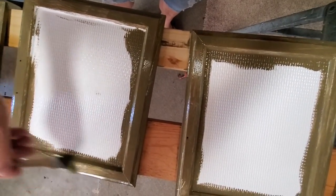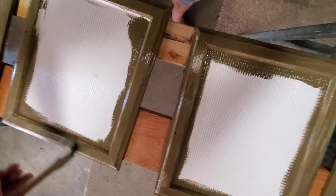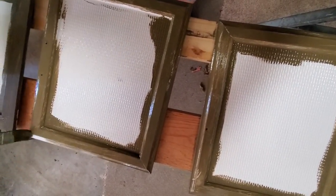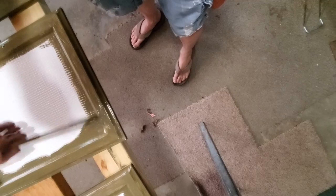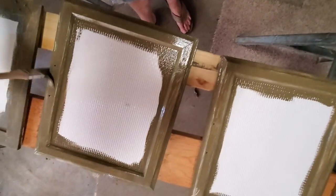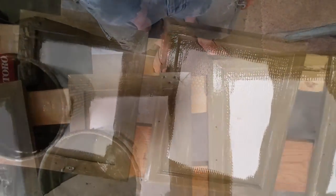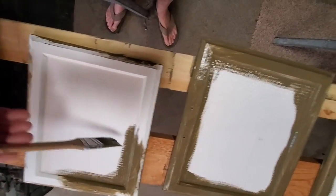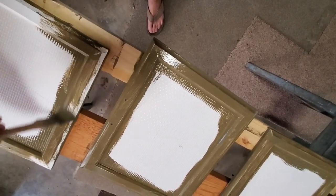About three years ago I had painted them a lighter color, and before that they were like a wood grain veneer. So the first initial paint job when I covered the veneer, I used a primer. If you're painting for the first time and you have that veneer wood look, you'll want to go ahead and put a primer on it so your primer sticks to the veneer and then your paint sticks to the primer. It's a pretty good system.